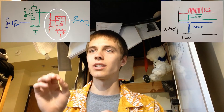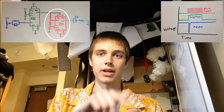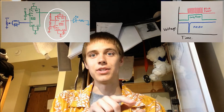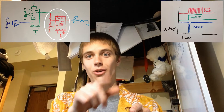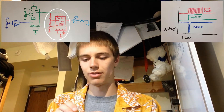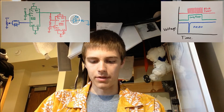The second timer, shown in red in the diagram, is the timer that does the blinking — it goes on and off repeatedly. When the first timer is high, the second timer is going on and off. So the result is something that blinks on and off for about a second and a half. The second timer outputs directly to the LED, and if I plug this in, you can see the LED doesn't actually make a very big spot when it's that close.